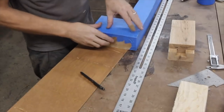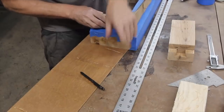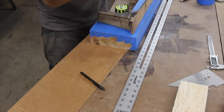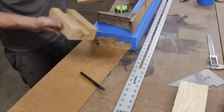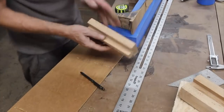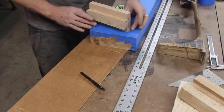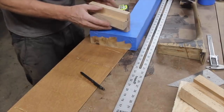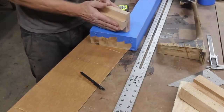You can see here I have both, most of the math basically figured out. This is a neck that was cut off before. There needs to be a block of wood here that goes out over the body. Here's that angle I was talking about, and here's where I want that dovetail. So I could cut it on the table saw like I did here, but it gets tricky because I have to have a stop here and it's going to be at an angle. So I'm not sure if that's something I'm going to be comfortable doing, all those compound angles. So instead what I think I'm going to do is cut a block like this, get my nice dovetail on it, and then glue it into my assembly here. That will give me a piece of wood with an alternating grain, which will add to my structure and stability. And then I'll just have some very basic math to work that in, I think.